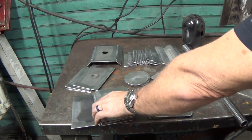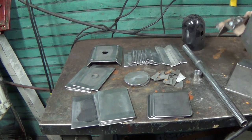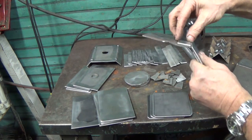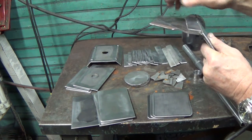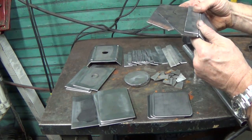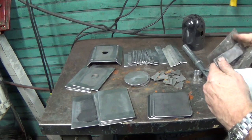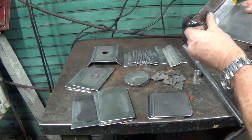So that when I go to make these boxes, I can clamp one, use my outside 45 jig to put these on properly at a 45-degree angle, and I can tack them or weld them or whatever I need to do. Get them all aligned, clamp them in place, and then tack them. And then once I have that, I use this inside 45, inside 90 rather, I'm sorry.